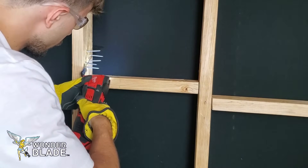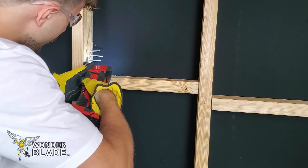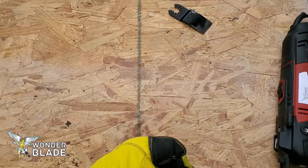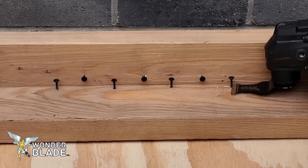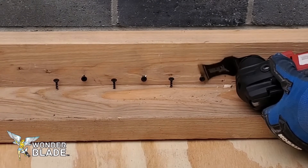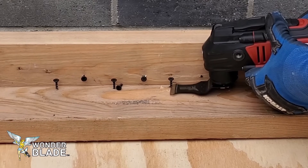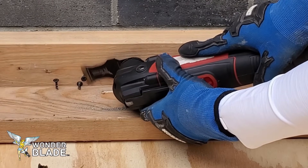That's where an oscillating multi-tool comes in handy. With an oscillating multi-tool, one thing to note when cutting steel sheetrock screws or metal is that you have to have a good quality blade. Most oscillating tool blades will not do the job. This right here is our high-strength carbide oscillating tool blade. This blade is perfect for cutting screws and nails, as you can see — it seamlessly cuts through those and can cut a wide variety of materials, which we've mentioned in past videos.